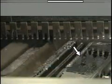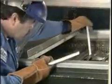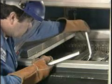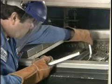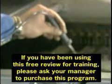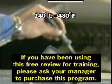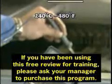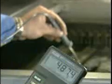At this point, check the solder in the solder pot. The solder level is usually kept slightly below the lip of the pot. If it is needed, add one bar of solder at a time to obtain the proper level. Don't forget to wear gloves and a face shield in case of solder splash. Check that the temperature of the solder is within the recommended range, usually 240 to 260 degrees C for eutectic tin lead. Note that temperature shouldn't vary more than plus or minus 5 degrees C from nominal temperature regardless of the alloy.